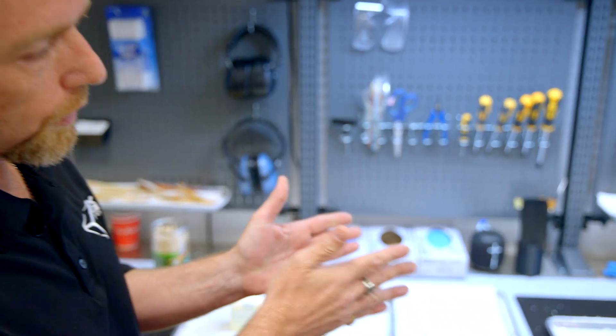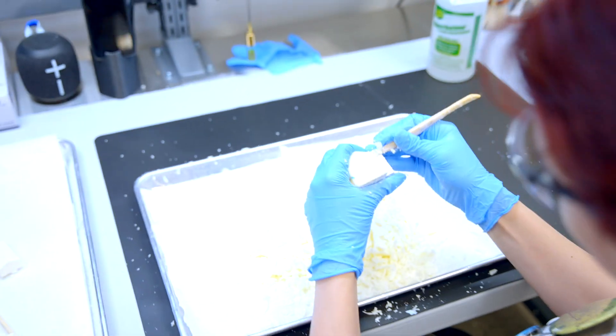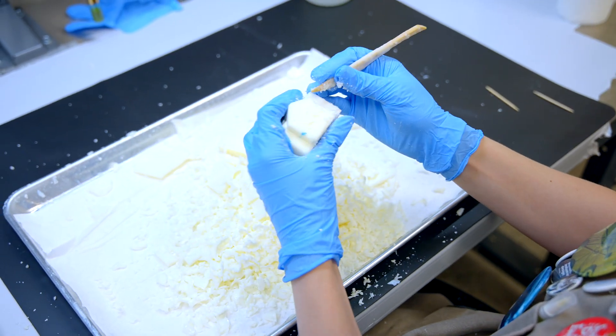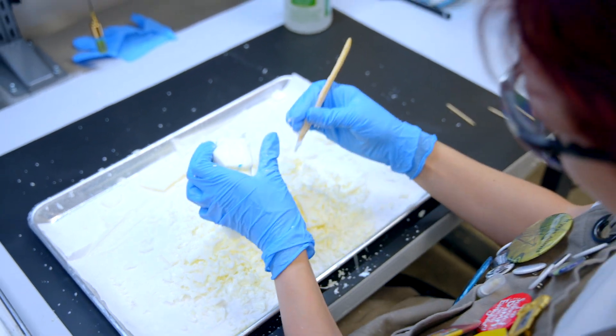Let me show you how we clean these parts after they come off the machine — it's actually pretty straightforward. The first step is a manual support removal where we use wooden tools to scrape the support material away as much as possible, really to minimize the amount of time the product spends in the water bath. Once we complete that, we put it in an ultrasonic cleaner. There's a clean and a dirty bath, so we melt off most of the support material, move it to the clean water bath, and then it's all finished.